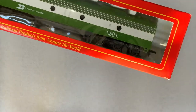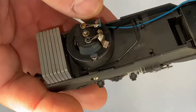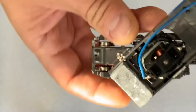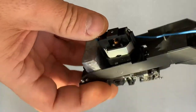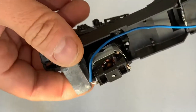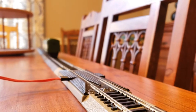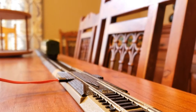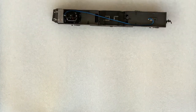What I'm going to do is convert this Burlington Northern E8B unit for you, and here is the chassis I'm going to convert. It's interesting that you'll notice there's only one wire going into it — the first time I saw that I wasn't quite sure what to do with it, but now that I've figured it out, I'll help you. Before you begin any kind of analog to digital conversion, you want to make sure that the locomotive you have in your hand is actually going to run. You absolutely have to test it out on a DC track first, because if the motor doesn't run, you could blow out your DCC decoder before things even begin.